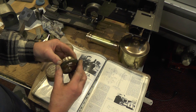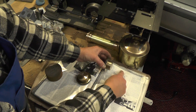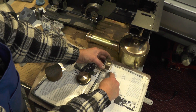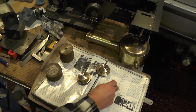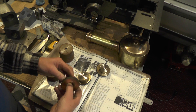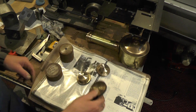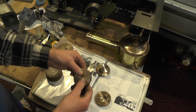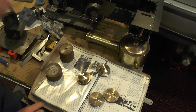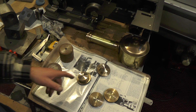I've got these two pieces which I'm going to solder together, and these two pieces, and that will give me a piece of brass or bronze with enough material to make the rear side of the cylinders. Then for the front caps, they're just blanking caps - I've got a piece of tubing and a piece of solid to silver solder together that will make me one cap, and same again here for the other cap. Once they're silver soldered together you won't notice the difference - it'll just be like one lump of metal. So I'm going to get them silver soldered and get over to the lathe and get these machined out.